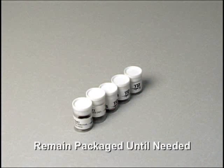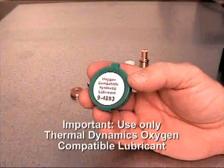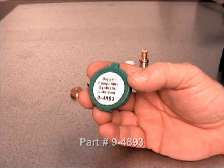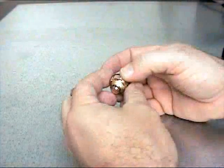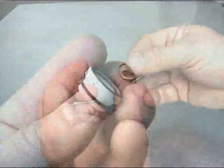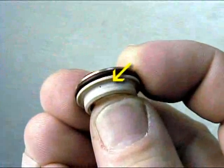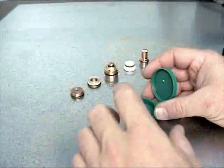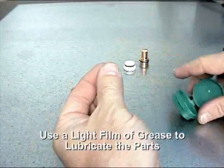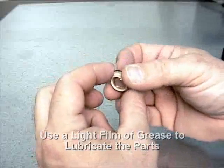It is recommended that the parts remain in their containers until they are ready for assembly. When reinstalling existing parts, it is recommended that a light coating of lubricant — Thermal Dynamics part number 9-4893 — be reapplied to the O-ring surfaces before reassembly. The lubricant should be applied very conservatively, as over application can result in clogging the small orifices in the parts. A thin film is all that is required. This can be achieved by rubbing a small amount of lubricant between the thumb and forefinger until it becomes transparent, then gently turning each part against the lubricated fingers to apply a light film.